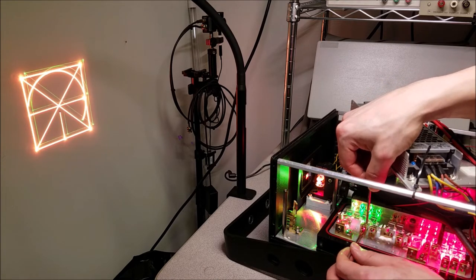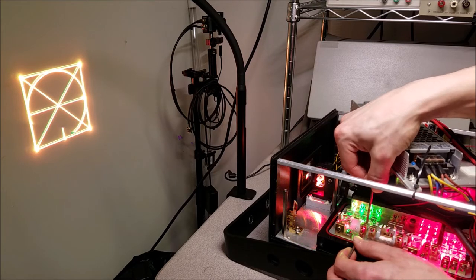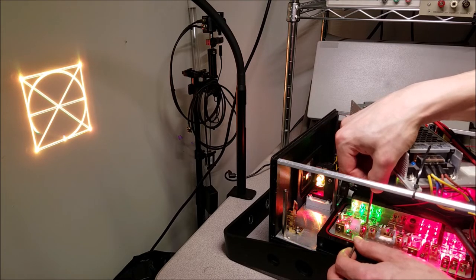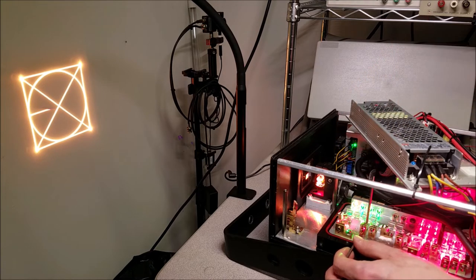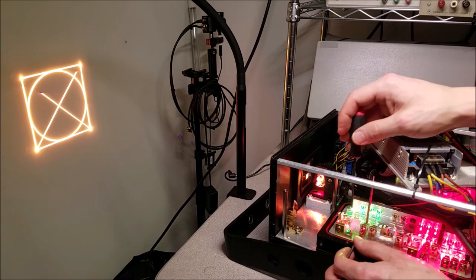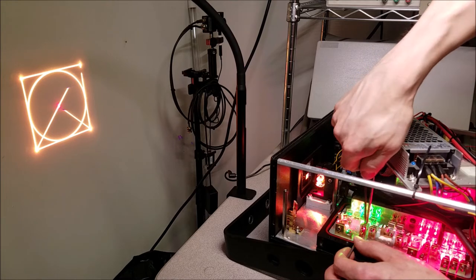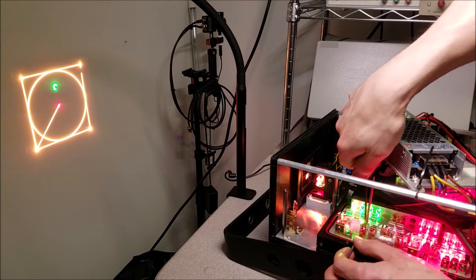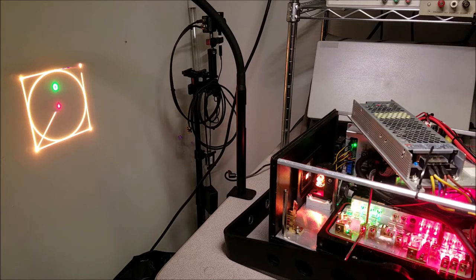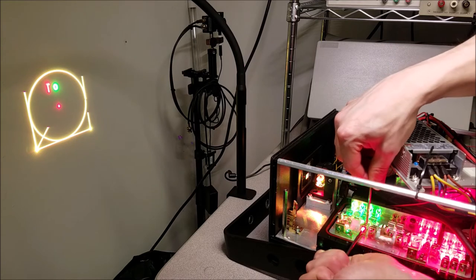Because if you're going to do these, you really do need to set the alignment, wait a good day or two, and come back and make sure that alignment is good. And if you do that, you don't even need the glue, because you're not trying to ensure that the torque isn't going to give you problems later. You've already let all the material stress out. And it does help to cycle the laser on and off too during the settling process before the final alignment,